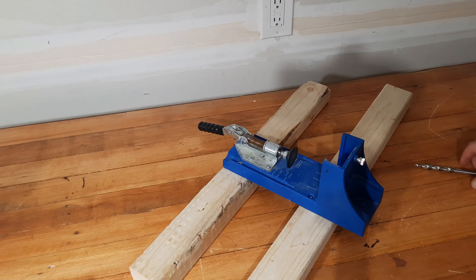You'll notice that I do have my pocket hole jig mounted on these two two-by-threes. I have that there to save me having to clamp it down, since sometimes I don't have a place to use my pocket hole jig. It would be nice to have a permanent setup, but this way I can move it around. It's supported enough that it doesn't tip over, so if you get a two-by-six in here that's say six feet long, it won't twist over — this stops that from happening. I've got this two-by-six here that I'm going to use for demonstration purposes.